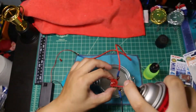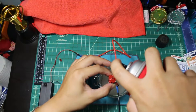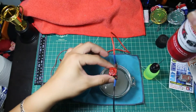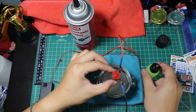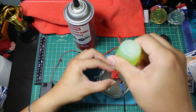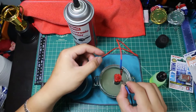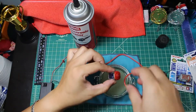I turn it off and start cleaning it. Spray CRC electronic parts cleaner from the end bell cap where the holes are. You can see the carbon buildup — the water gets dirtier. Then I put more oil on it. This cleaner is quick-drying, so it should be good enough. Oil it up and the dirt starts coming out — just shake it like that.